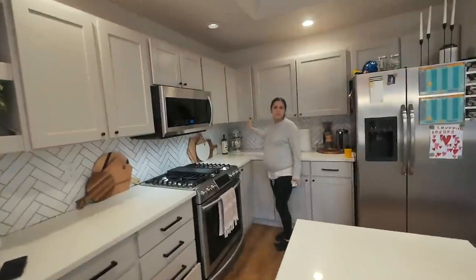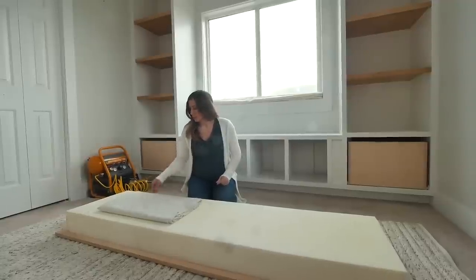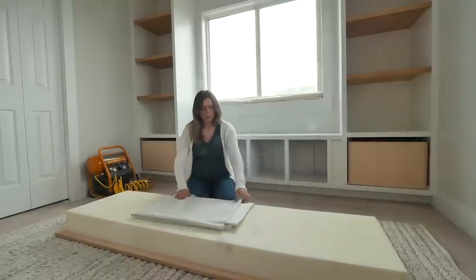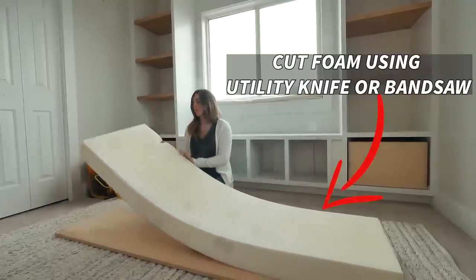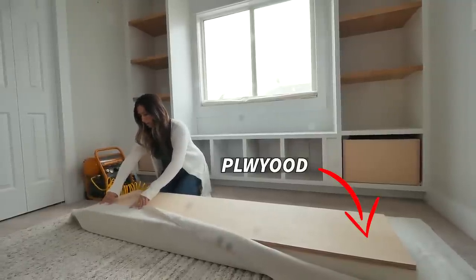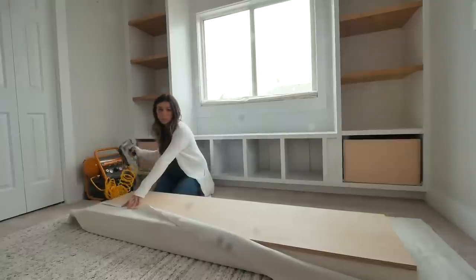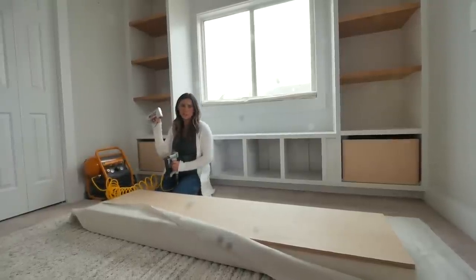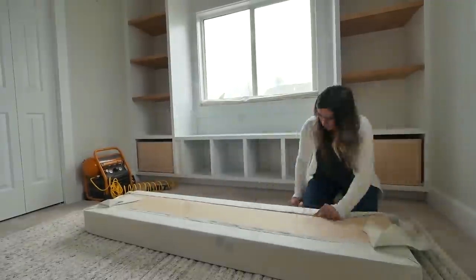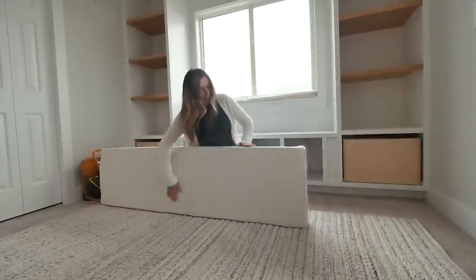Can you show people how to upholster a cushion for the bench area? Sure! The supplies you'll need are: a staple gun, your upholstering material — I use a thick linen fabric — and a piece of foam, we used 5-inch foam. Pull it super tight, then fold over about an inch of the fabric on top, which creates a thick barrier so the staples stick better. Use an upholstery stapler. Once you have that all stapled, flip it over and see how nice and tight it is.